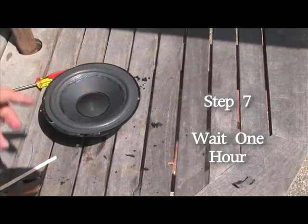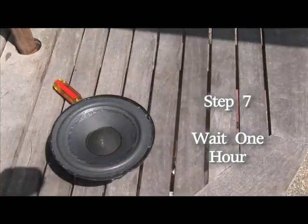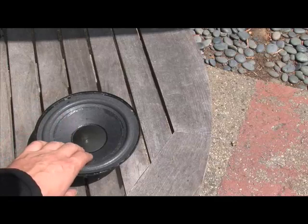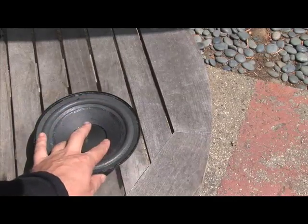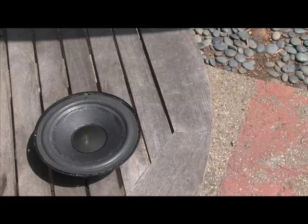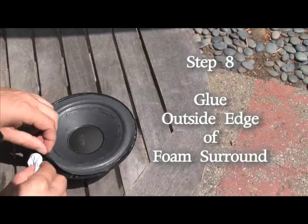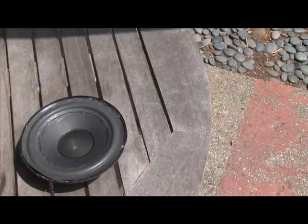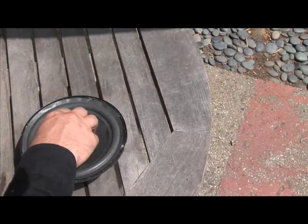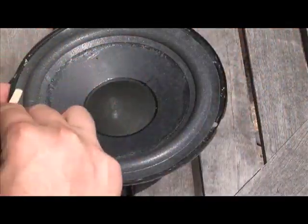While we're waiting an hour for the edge to dry, I'm going to take this time to clean up. Before we glue the edge of the new foam to the frame, push around the cone a little bit to get a feel for the center of the assembly. The cone can easily be moved in one direction or the other — you can also see where the sweet spot is and there's no scraping in the voice coil. Use your fingers just to distribute the glue a little bit, make sure that everything's even, and exercise the cone just to make sure we're getting things centered and getting the new foam placed in the correct position.